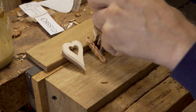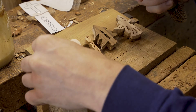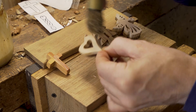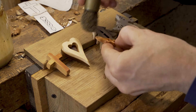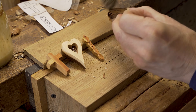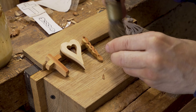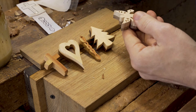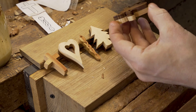From there we carve out our little love spoon just to add a little bit of extra detail, and we go on to adding three coats of shellac sanding sealer. You put the first coat on and it raises the grain so you get a rough finish. Rub it back down, put a second coat on, and then a third coat usually brings it up to a good finish.